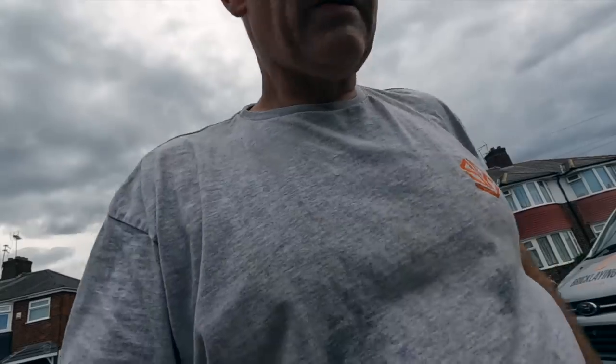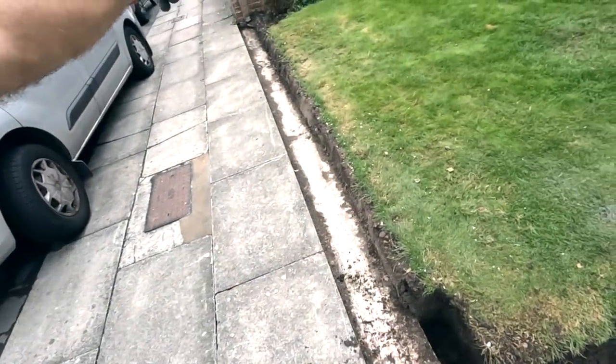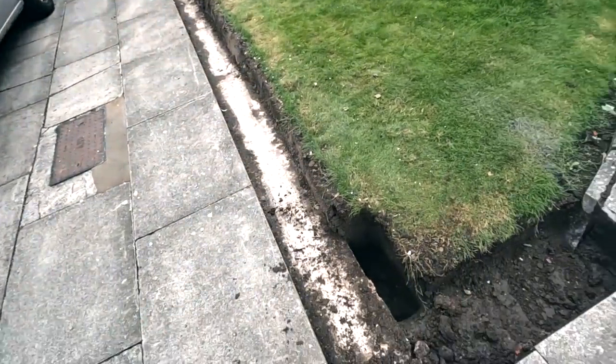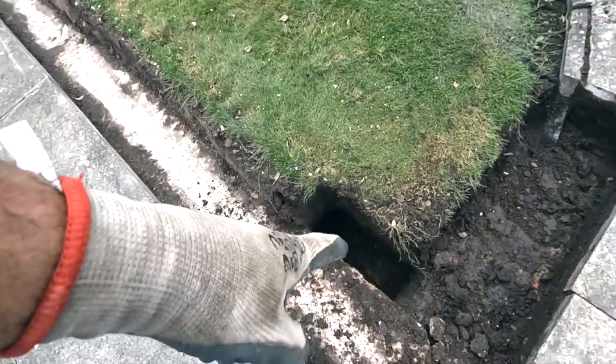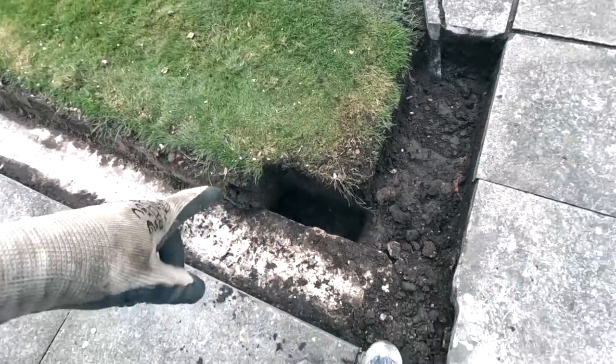I think I'm ready for lunch. It's just gone 12. Just to move the laser level, so that's our high end. So no bed at the top, I'm just running it down this way. I've dug down there about a foot. That's just an extra bit of concrete for the pillar. We're having a brick and a half pillar at this end.